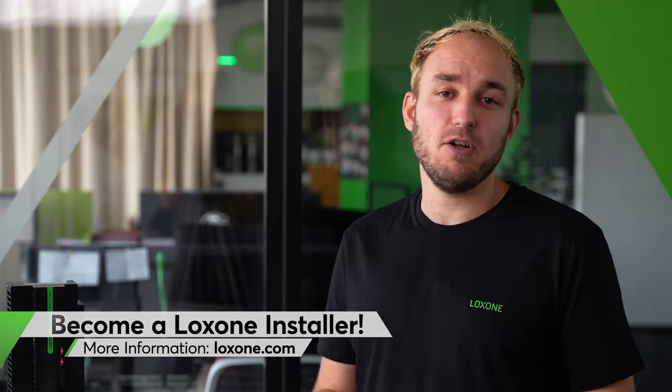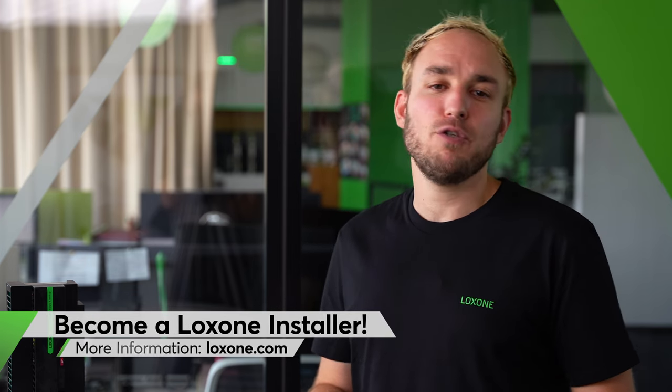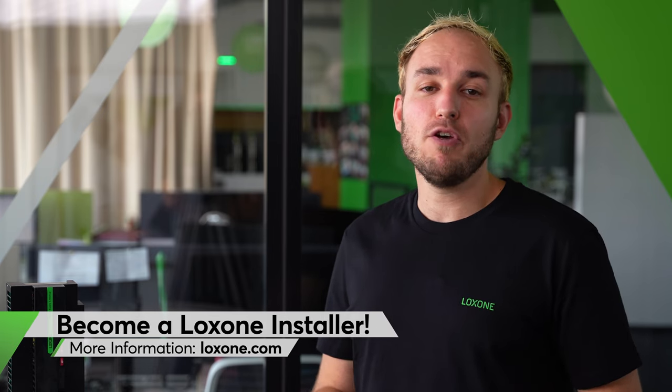Pro tip! Thanks to the freely configurable Loxone config, you can now implement logic, statistics and much more based on the needs of your customers. To maintain emergency power operation as long as possible, I can activate an operating mode when switching to battery operation which causes a maximum brightness of only 20% to be activated when lighting is required. Our new power supply and backup function block reduces cabling effort enormously. Thanks to the integrated fuse, there are no costs for fuse clamps, and you always have an overview of the required performance of all Loxone components. The backup function ensures that the entire building — including lighting, audio, peripherals and sensors — remains fully functional even in the event of a power failure.